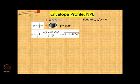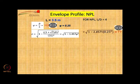Then we have to calculate the eccentricity of the envelope. Eccentricity is given by this formula, root of 1 minus 1.457 xi square. Xi we already know as 0.25. So, this is the second calculation for you. Take a pause, calculate the number, and then when you are ready, you can play the video and compare with the number which we have calculated.